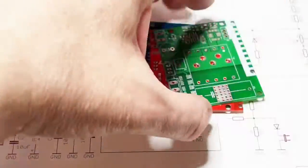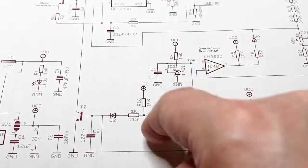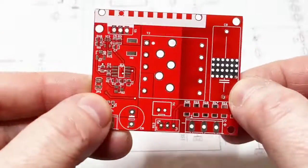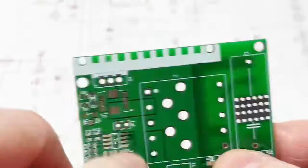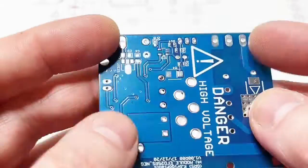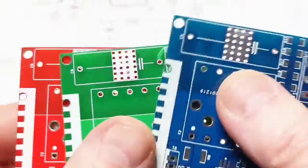So beautiful — these are the PCBs. These are the designs I made based on this one, with all the changes, stabilizations, and mods I needed. Why are there three? The red one is my design using a current sensor resistor and differential amplifier. The green one is the version with a current transformer. And the blue one is the version that gives you a negative voltage output. All three go up to 1000 volts output — this is why I made them.